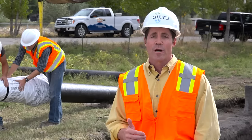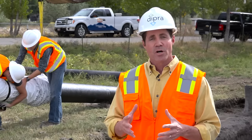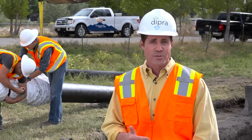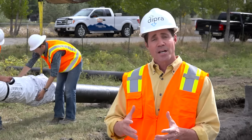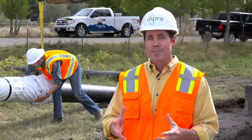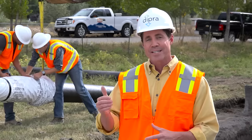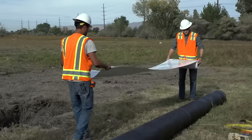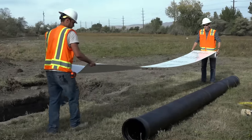There might be times, however, when pipe needs to be installed in areas with a high water table. This will require a few additional steps. This method can also be useful when installing V-Bio in areas where it's wet and sloppy as a result of rain. Begin as described before under the dry installation method description.